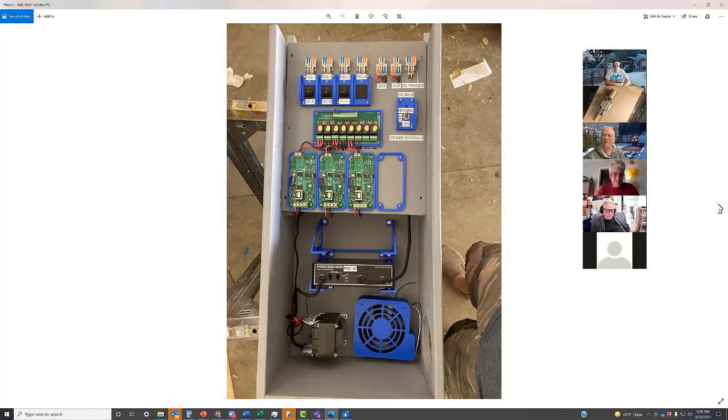So you can actually power the loops on DC. But what's going to happen is all the turnouts will go to normal. So you can be on a loop running DC, but you can never leave the loop, and everything outside the loops will be turned off. At the top, you can see there are 3 outputs: DCA, which is the DC A blocks, DCB, which is the DCB blocks, and then everything else, which doesn't get powered.